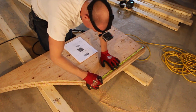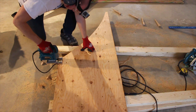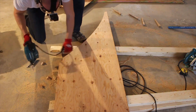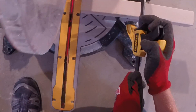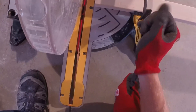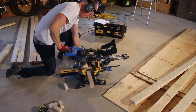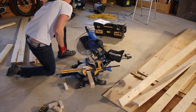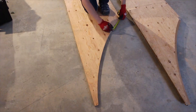To accommodate the coping, you will need to notch the sides of your ramps. Measure two feet along the top and one and a quarter inches down, then cut this notch out with a jigsaw. Do this for all four sides. You'll also need to trim your two by four pieces — for the full eight foot ramp I trimmed one and a quarter inches off each board, and for the ramp that fits inside this ramp I trimmed three inches off each two by four. I made the cuts using a miter saw, but you could use a jigsaw or circular saw.